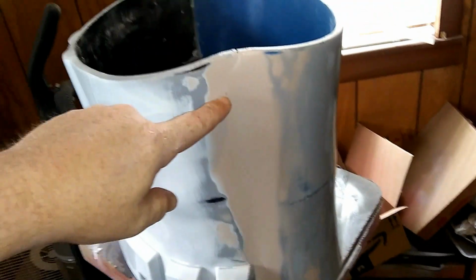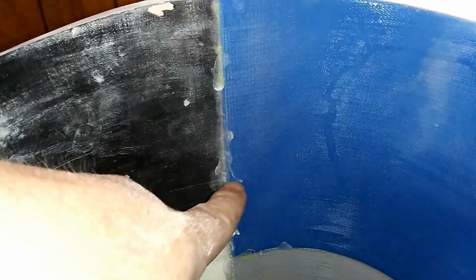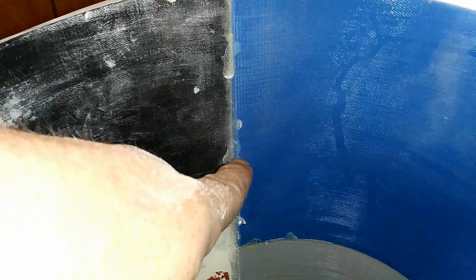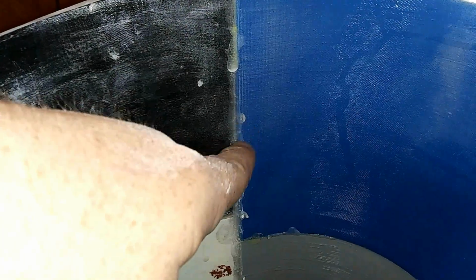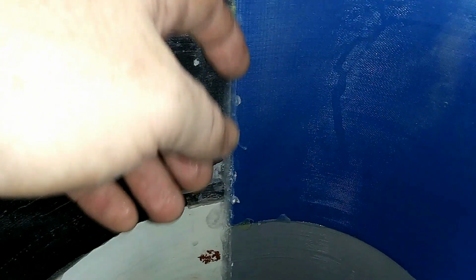So I did have the front piece here, and the back piece here as two separate pieces, but I went in today, and you can see I put Bondo. Well, I glued it together. I had already heat formed it, so it fit together really good. And then I used super glue and baking soda. Got this, it's like concrete.